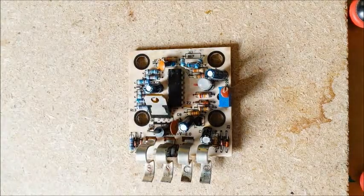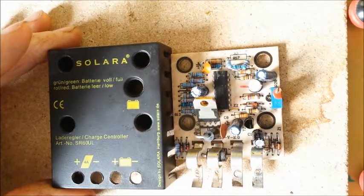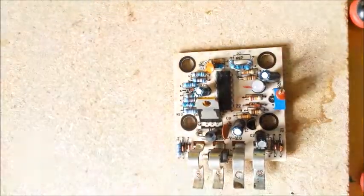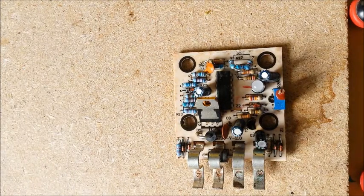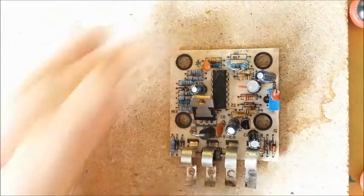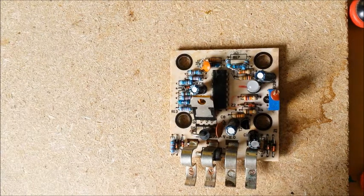What was wrong with this solar controller was that it would always show red — in other words, it would always say that the battery was on charge. The purpose of this solar controller is to keep the battery charged like a trickle controller, but the LED was always red, never turned to green, and it was always charging the batteries. One of our batteries developed a short circuit — we've got two lead-acid batteries in parallel — and I think that led to the battery going wrong.